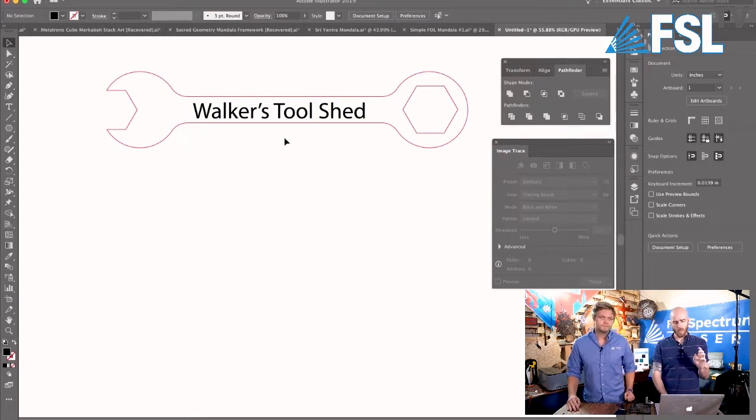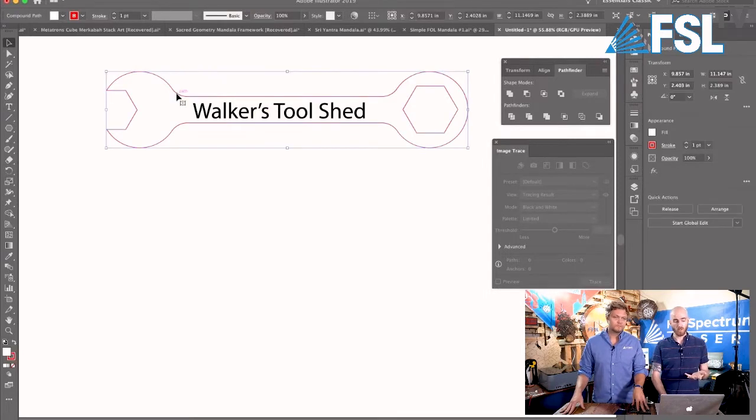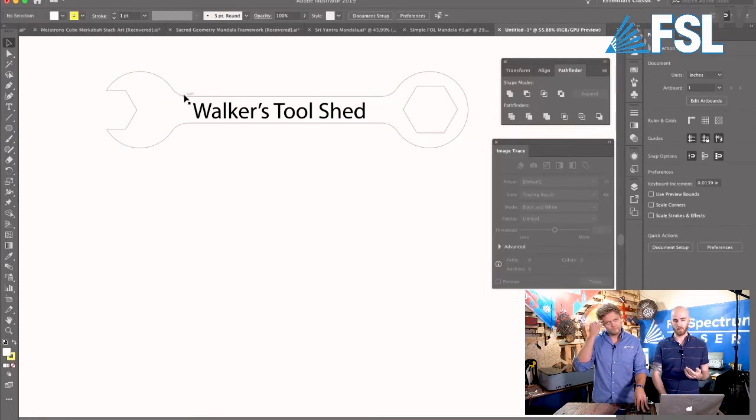Okay, so with the red line now, if you're going to engrave this, you can actually make this line yellow, which when you drag that into RE3, RE3's black and white threshold won't pick up the yellow line. It'll just pick up the black letters, which will enable you to engrave even better.